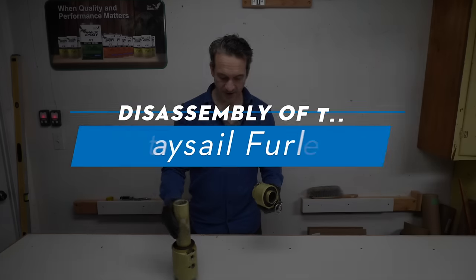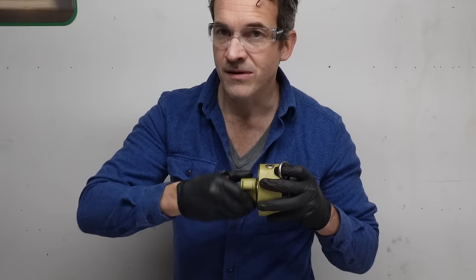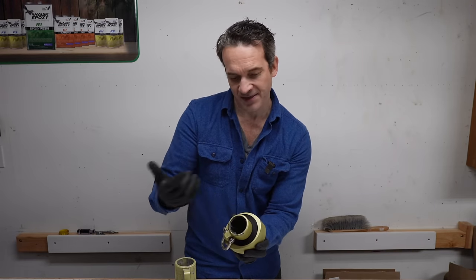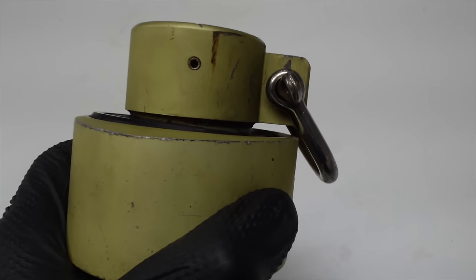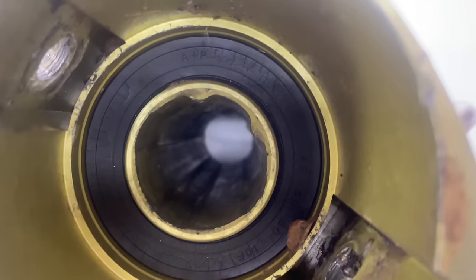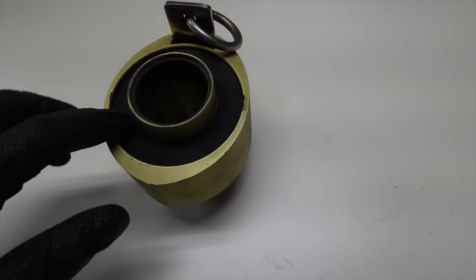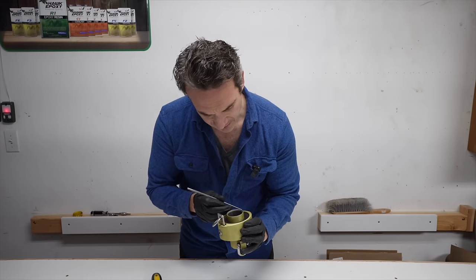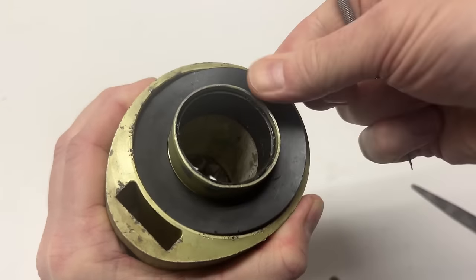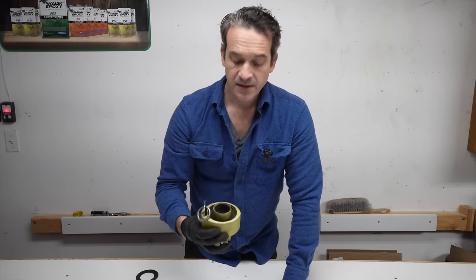This is the staysail furler. These two parts go together to make that system, and this has an audible sound to it and feels a little gritty when I'm turning it. I can even see that one oil seal is pressed in all cattywampus — it's on a visible angle. Let's see if we can get these swivels working as good as new. This one actually turns quite nicely, but I can see the seals are kind of cracked and drying out, so we'll replace all of this too. We're going to try to pull this little seal out here — you can see a screwdriver mark where someone was in before me.